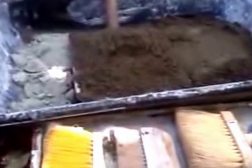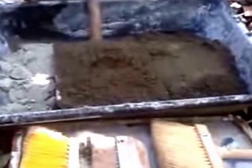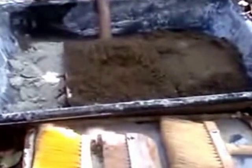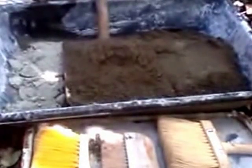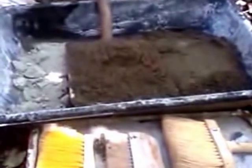So first, let's make sure we have the right mortar, and for this project we're going to use Portland and sand, and that's going to be 1 part Portland to 3 parts sand, and our measurement is going to be a shovelful. Whatever you're using as a unit of measurement, make sure they're the same, and use 3 parts sand and 1 part Portland. This will be roughly a type S mortar. There's also type M, N, K, and O, and that's for a different video. So let's just focus on laying fieldstones for today.